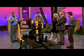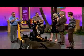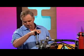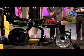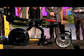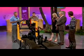Yes. And what's novel about this mechanism is the combination of two well-established mechanisms in agriculture that have never been joined together. And that was done by introducing a third element into this system, the press wheel. And it will automatically have a predetermined force placed on that press wheel, which creates the pressure around the soil. And of course, that soil pressure against seed gives you the needed soil contact for good germination. Fantastic. That's a great display.